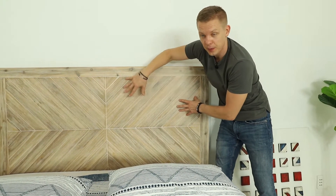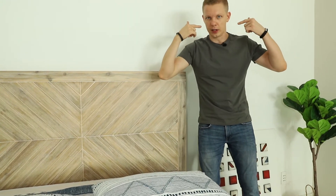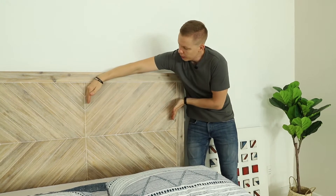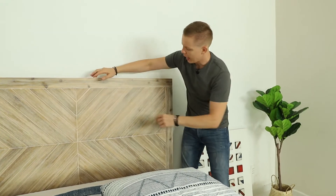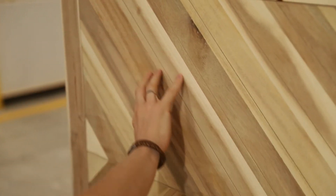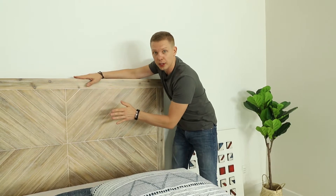The challenge was that when you put this under the wire brushing machine, it's always going straight. So we needed to take this panel and put it slightly on a diagonal way to put it through the machine. We also needed to control the wire brushing lines so they go in a straight line. That was the biggest challenge and we managed to overcome it.